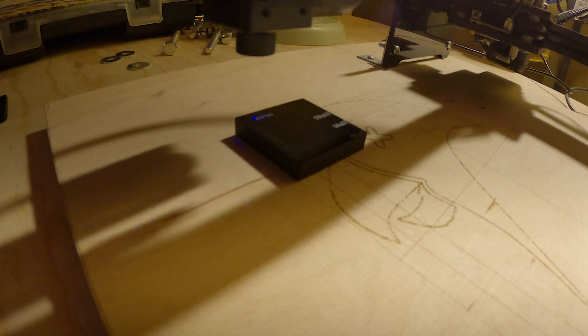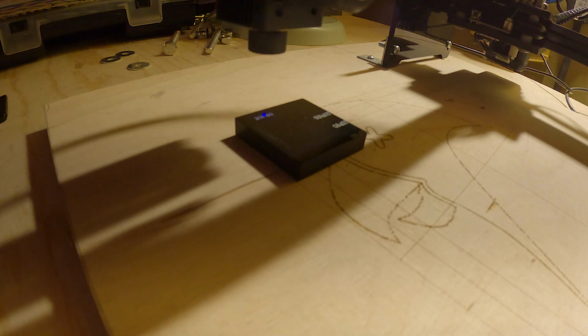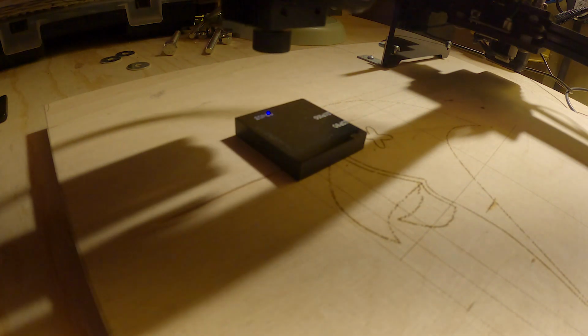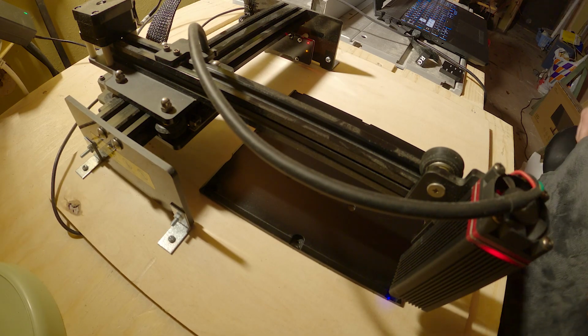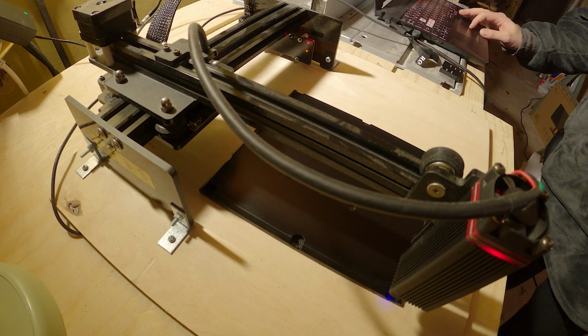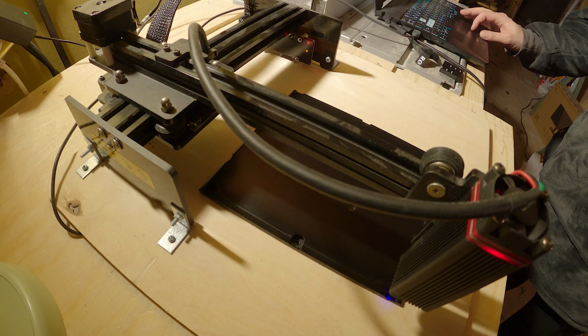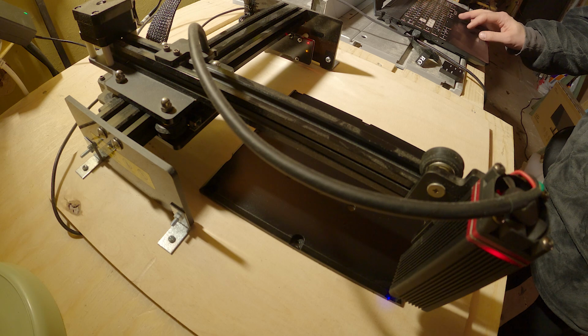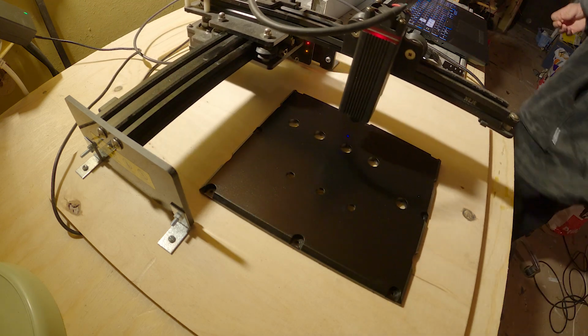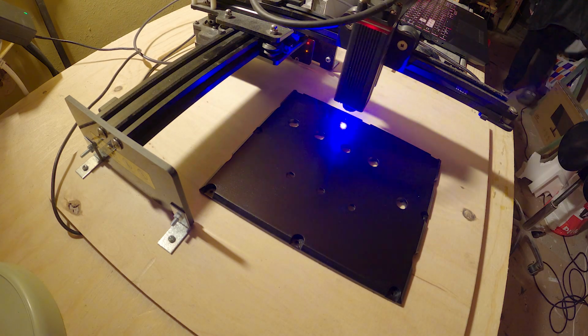Now I'm just taking this end of the roll filament that I wouldn't be able to use for most of the prints in any case, and printing out these small squares. And I just treat them exactly the same way that I'm treating the panel while I'm painting it. And when I'm happy with the settings, I'm just going to engrave the markings onto the proper panel. This way I won't have to redo the panel multiple times.